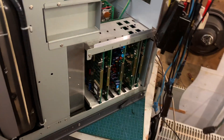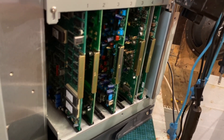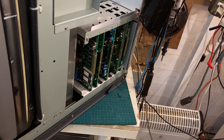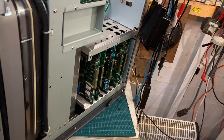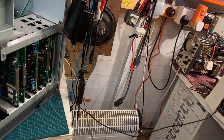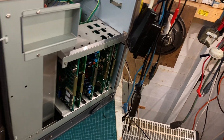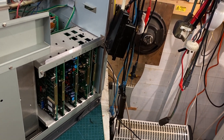I've cleaned the edge connector board connectors — these are very temperamental. Some of these boards use silver circle electrolytics. If they had started leaking or weren't a good batch you could potentially replace them. I'd suggest not using tantalums because tantalums have a different characteristic — they aren't exactly the same as electrolytics. They are known to short too, especially if placed between power rails. You've got to make sure that the ESR on replacement components matches the originals, otherwise you'll put unnecessary stress and potentially cause issues on particular power rails and damage sensitive components.